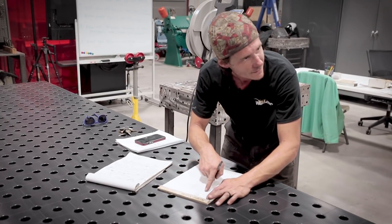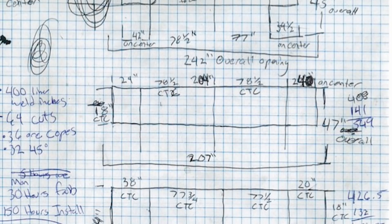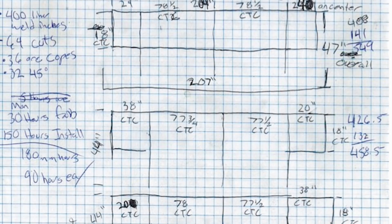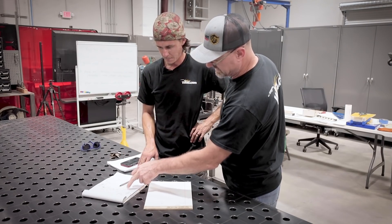See that there is doctor writing. I get paid like a doctor, I ain't smart as one. Are you for sure measured from center to center on that? Yeah. 20 and 3/8ths there — center of your top rail, center of your mid rail is 18 inches.